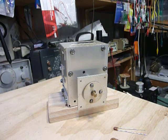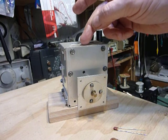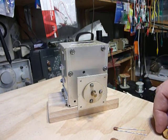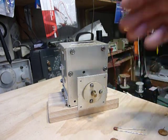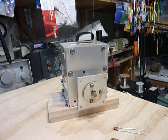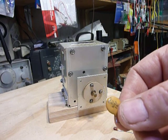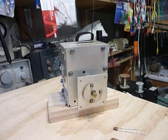The reason I adjust at 5.250 is that when you turn the capacitor to maximum capacity, the added capacitance takes away some of the temperature compensation. When you turn it down in frequency to 5 megahertz, you're adding capacity. When you turn it up in frequency, you're reducing the variable capacitor's capacity, which increases the effectiveness of the temperature compensating capacitors.